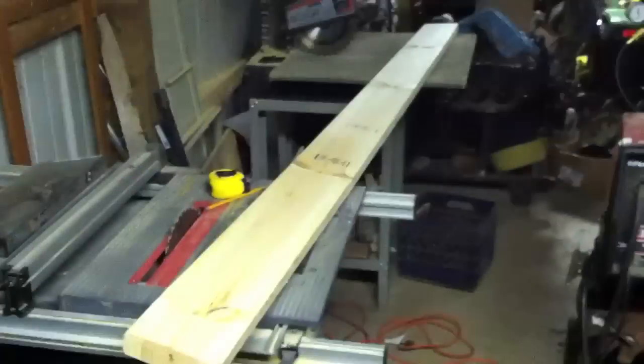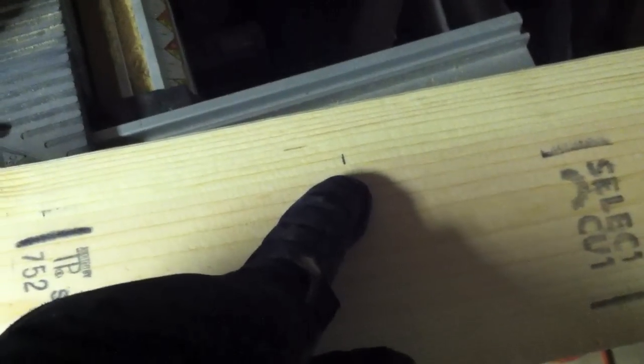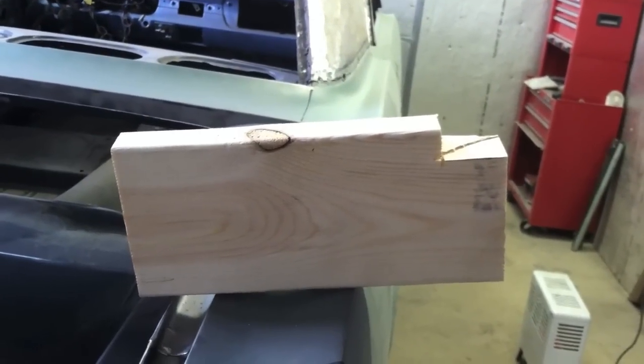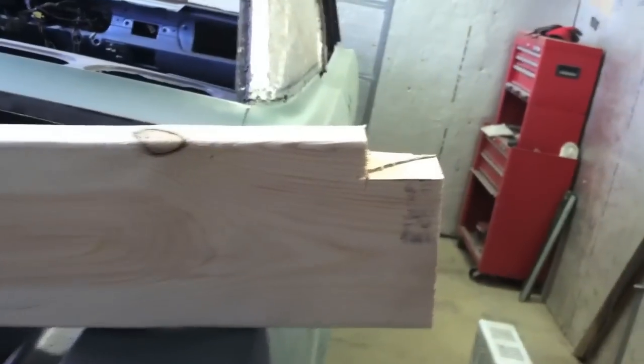So let me start off with this. My hands are shaking a little bit. I got some 8-foot 2x6s and I have marked them. I'm going to do a 6-foot width for the end boards, and I marked it at 3 feet so I know where the center is going to be, and I marked it at 6 feet where I'm going to cut. Next I wanted to make a couple of standoffs just to keep the wood away from the back a little bit. I took a 2-foot section of leftover 2x6, cut it in half, and notched out a 2-inch by 1-inch corner to fit that area.